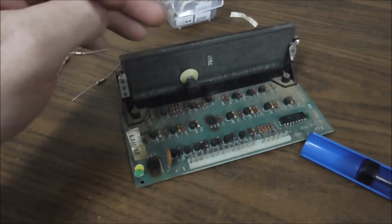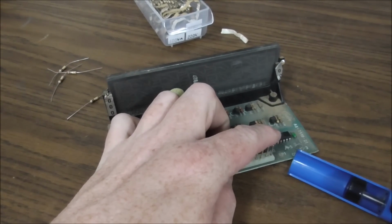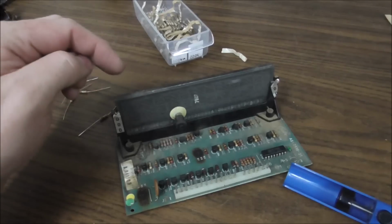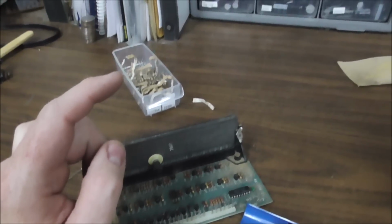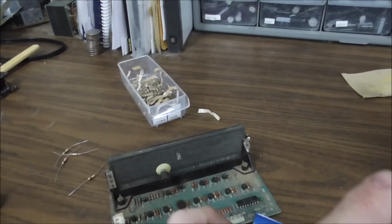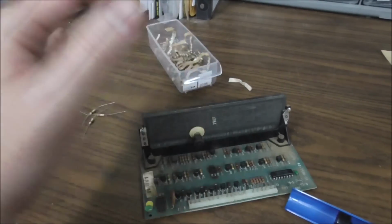If you then put it back in and you've still got issues, then you've got a problem with one of your transistors or with the decoder chip. If you get a bunch of garbage, where there's an entire segment missing or something, a lot of times it's the decoder chip. Or if instead of saying 100,000, it says 892,143 points, well, there shouldn't be a 3 on the last digit, so something's bad wrong, right? And it's probably that decoder chip.